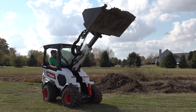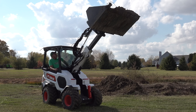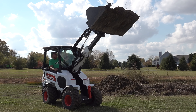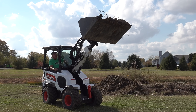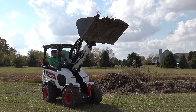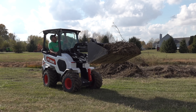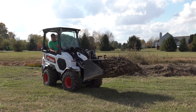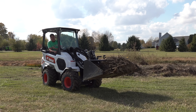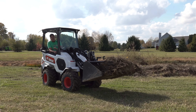One fascinating aspect is that there's a second version of this machine available with a counterweight — an additional 474 pounds of counterweight on the back end. With that addition, it's rated to lift 1,952 pounds rated operating capacity, which they call ROC. I really don't think we're talking about a hydraulic issue.